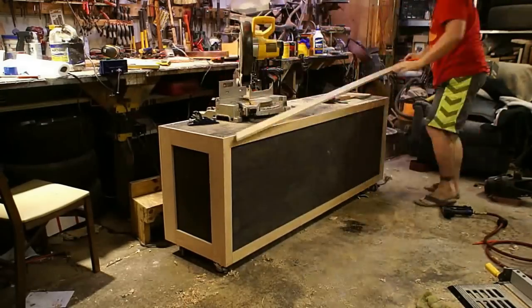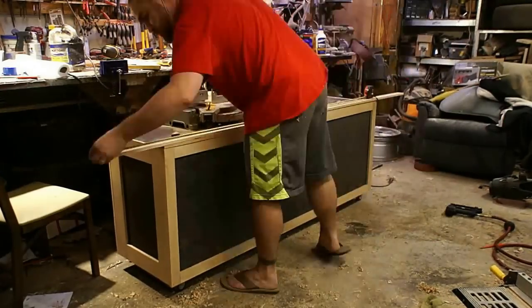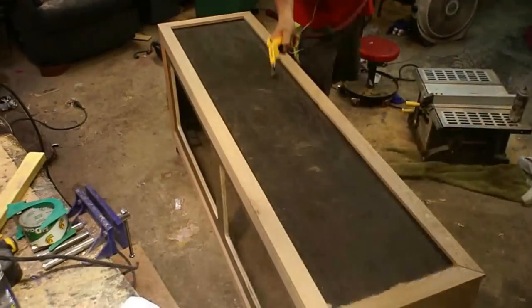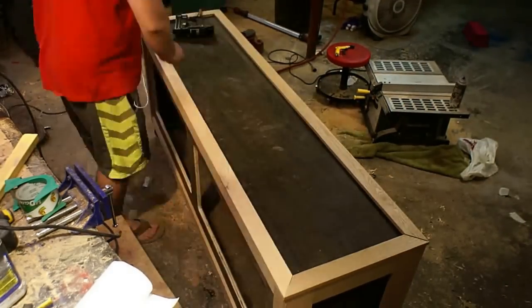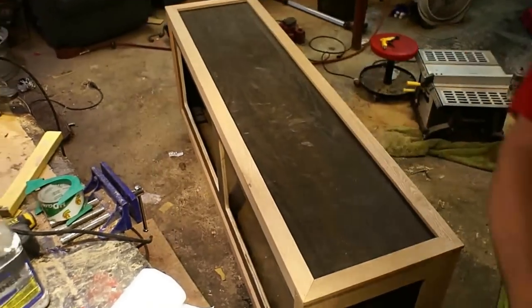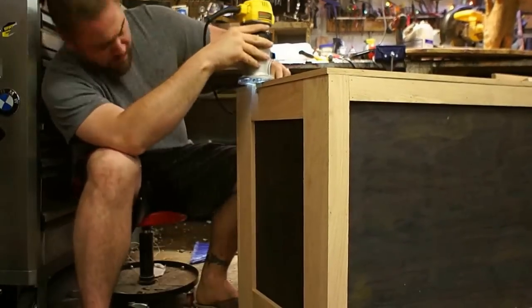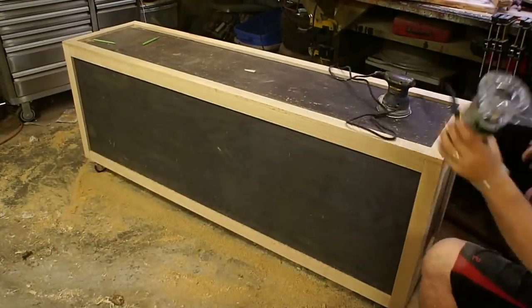In the sped-up video here I'm actually doing a mitered corner for the very top piece — I figured that would have a better finished look. On these parts I'm purposely leaving a bit of a lip that goes over the edge, so I'll be able to take my flush trim router after they're all glued and dried to true everything up. Doing a little look around — it's actually starting to come together and look like a finished base. I got this router as a gift from my wife; this is the first time I got to use it. I went and splurged on a really expensive bit to make sure there wasn't a whole lot of finishing work afterward.